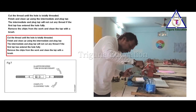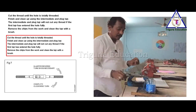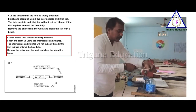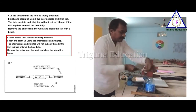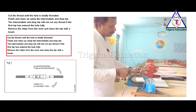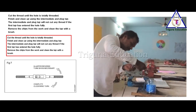Let's enter the intermediate tap. Remove the chips from the work piece with a brush. Then apply the intermediate tap, which continues forming the thread. After the intermediate tap, we use the bottom tap — this is the last tap, which completes the thread to the very bottom of the hole.